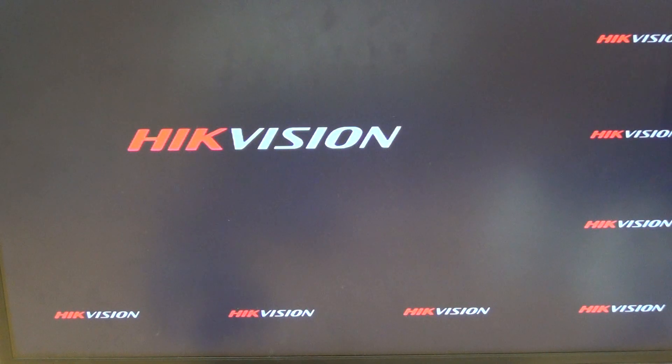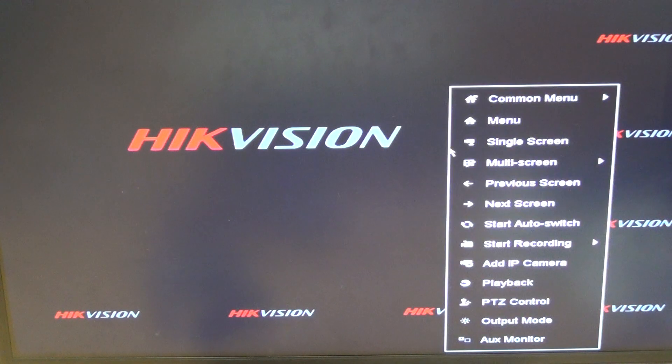In terms of the setup I have here: I have our NVR and a connection coming off a switch which has two locally powered IP cameras, and the output is being displayed on the screen. I'm going to use a LAN connection coming off of the switch and plug it directly into the LAN port on the back of our Hikvision NVR, so now I have the two cameras connected via the switch.